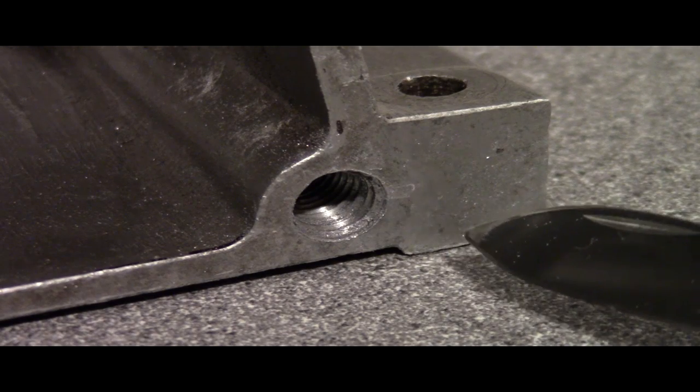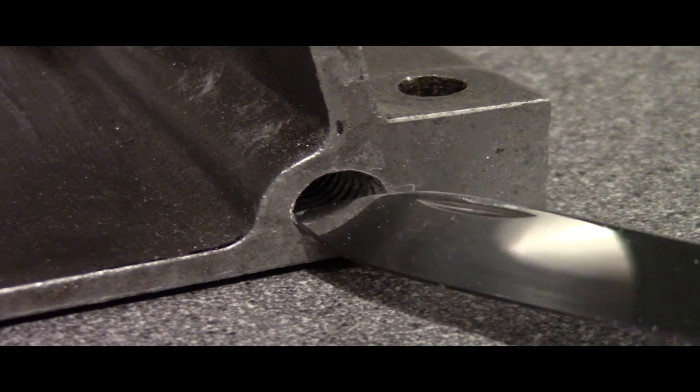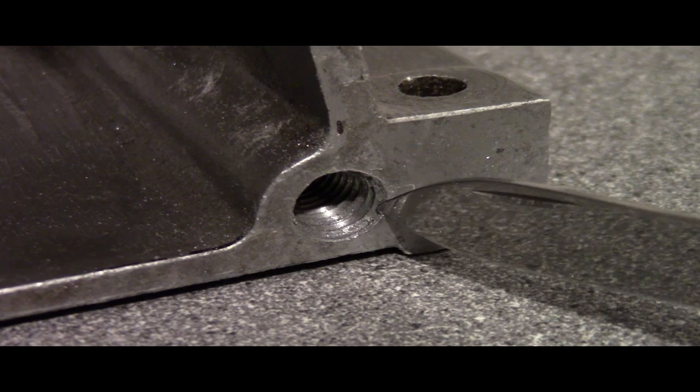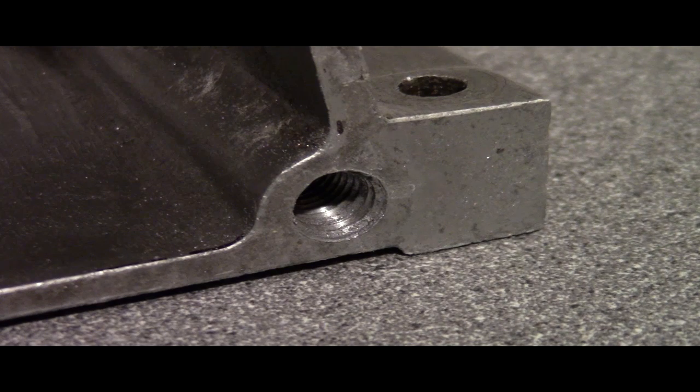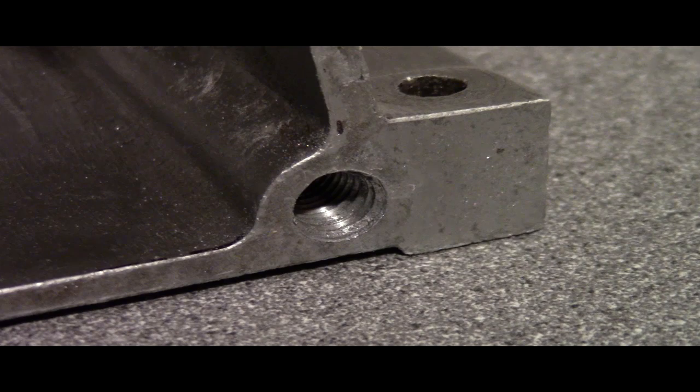As you can see there's the 10mm metric thread. Just for about 3mm on the inside, I've drilled out the thread to the full outer diameter of the thread. I've done this so that on the thread insert I can make a little collar that will sit against the start of the thread just inside there, so that I can screw it in and it will lock at a certain point rather than screwing all the way through. Because of this, the locating stem will protrude a fixed amount out from the crankcase as I want it to.